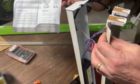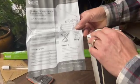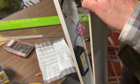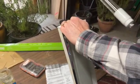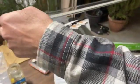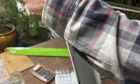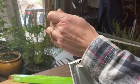These are the instructions we're using — you want to make sure you follow these. The big thing is, with this particular fixture, there are a lot of different LED lights you can get. Some you don't even have to switch out any of the wiring and can just use the ballast, but this ballast is very old. This LED tube is called a single-end, which means you power it from one end. A regular fluorescent light is powered from both ends, but we're going to redo the wiring so power comes to just one end, with two little plugs — power from one end into both sides.